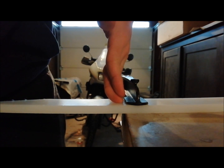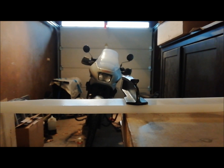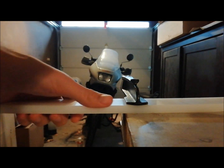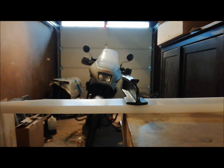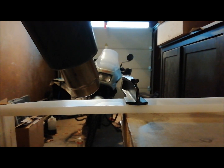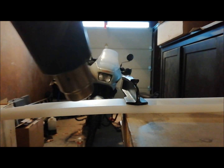The heat gun goes on. What we're going to be doing — and I hope you'll be able to see — is that the HDPE is quite glossy right now; you can see it reflecting the light easily. We're first going to heat this part, and you will soon see the gloss disappear into a sort of matte finish. There it goes — you can see it happening. This is the first stage. It also makes your HDPE a lot easier to write on and to paint, by the way. You can see it's starting to bend as well.